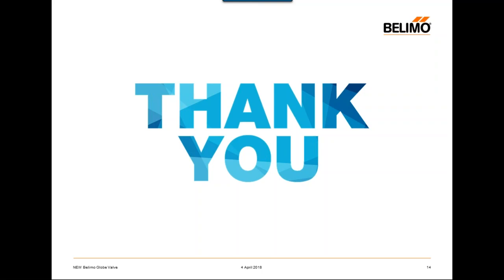Question: Will the SGVL retrofit go away? No — the SGVL retrofit kit is not going away. That kit is still suitable for the Schneider globe, which Schneider will continue to sell. Follow-up question: Can you use the SGVL linkage kit on the new globe valve? No — the SGVL kit is specific to the Schneider globe valve and the interface is different from our new Belimo globe, so it won't fit. If you need a replacement actuator, you will need to buy the BGVL kit so the actuator can easily mount to the new Belimo globe.